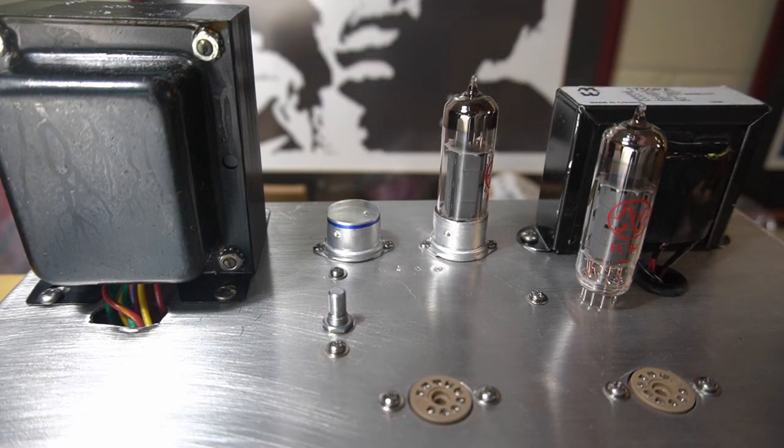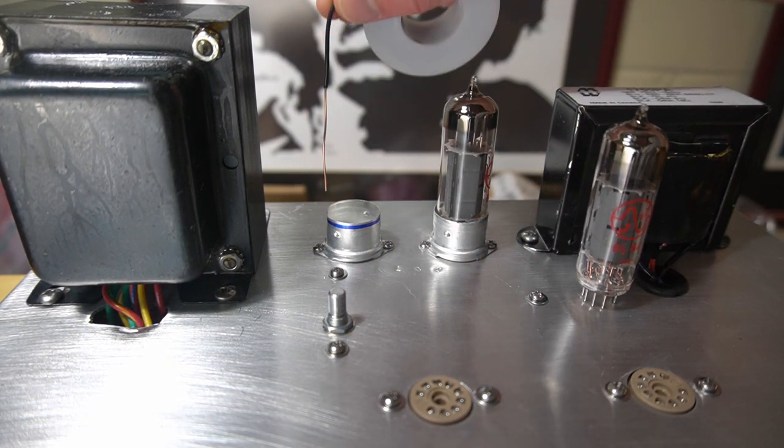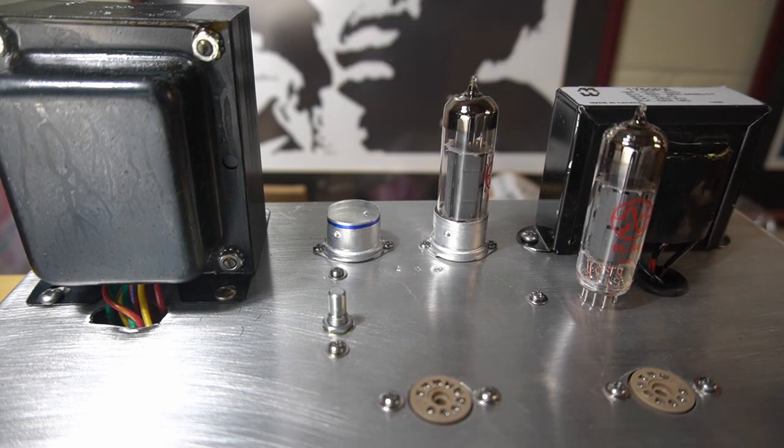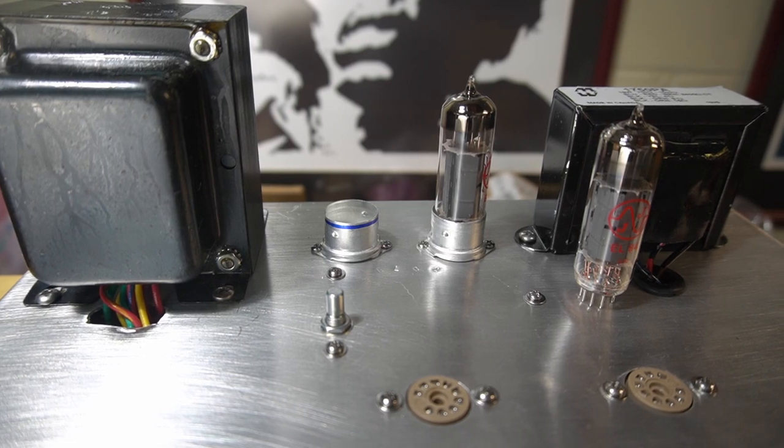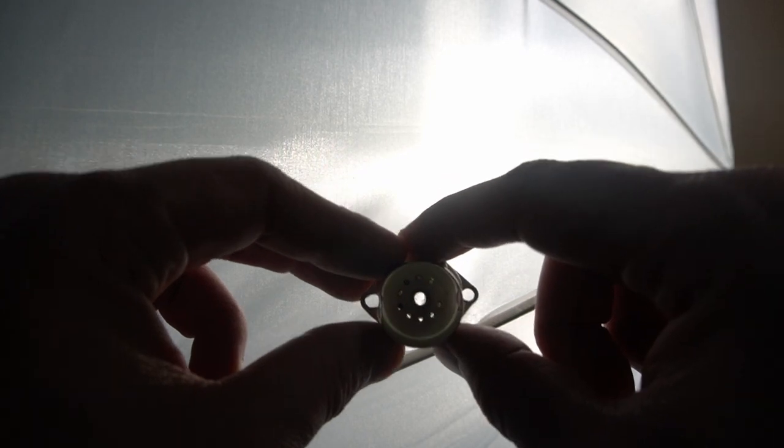So that's annoying. I think what I'm going to try to do is have someone help me. I will have them man this wire and try to push the wire in, and I'm going to take the soldering iron from below, see if I can clear the way, but that's kind of annoying. Worst case scenario, I'm going to have to change out the tube socket. So, I guess we'll keep going. Alright, this is the tube socket. I'm honestly not sure how well you're going to be able to see this, but...